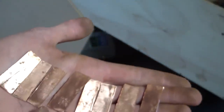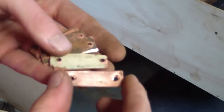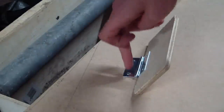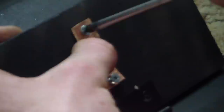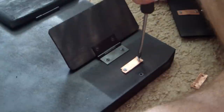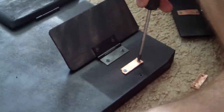Take your copper sheet and cut out 40 by 12 mil pieces, and drill appropriate size holes on either end for your very small screws. You're going to need double the amount of pedals you plan on using — so for me that's 12. Then screw the hinges and pedals in their appropriate places. Once done, screw the copper strips on top of the pedal and on the bottom of the baseboard at 90 degrees to each other, so that when the pedal swings down they contact each other.